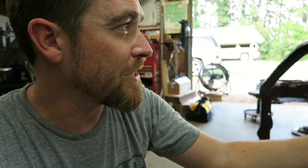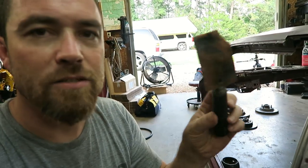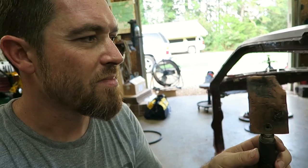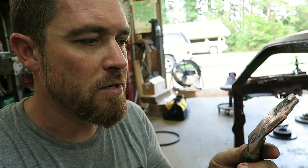So I'll tell you a little trick. I actually did a video on this a long time ago. It was a Friday video, but I got 100 of those things now, so it may have been a long time ago. Take these little copper spoons, just a little copper plate, and anywhere you're blowing through or you need to fill some holes, you can just put this on the backside. Then you basically just weld straight to this, but it won't attach itself to the copper. You can just pull it right back off and it'll release.